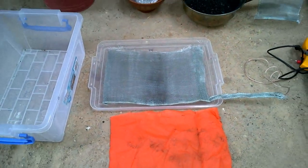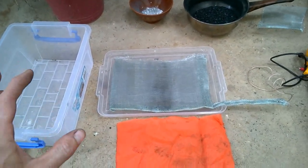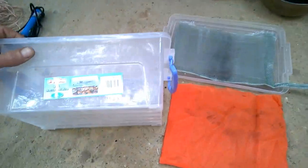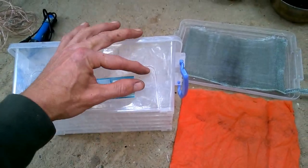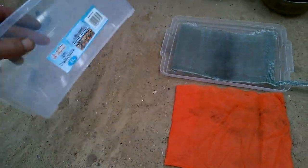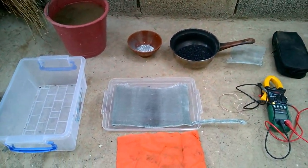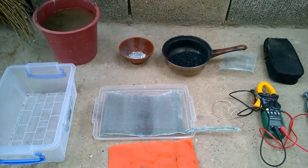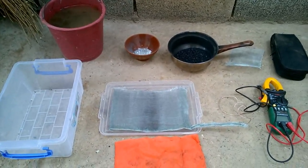Essentially what's happening is as the microbes live in the bottom of the mud, break down the sugars, they release the energy and you want to capture that. The key parts here are anaerobic and aerobic respiration of bacteria. In the bottom of the tank — I'm using river mud dug from the bottom of the river — you have your anaerobic layer. Then you have your upper electrode, and above that you have water which you need to get some oxygen into. This sets up your battery. Things that affect power output are the surface area of your electrodes, the amount of microbes available, the mineral content of the mud and water, the amount of sugars available, and the amount of oxygen available.